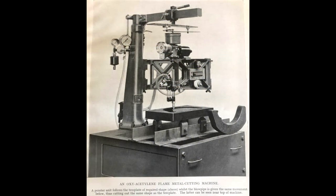He eventually identified that flame cutting needed to be more accurate and more speedy if it was going to be used in the production environment, and he then went on to develop a machine system which required a hand-held roller following a wooden template, and this had a single torch. This was known as a U-Arm machine.